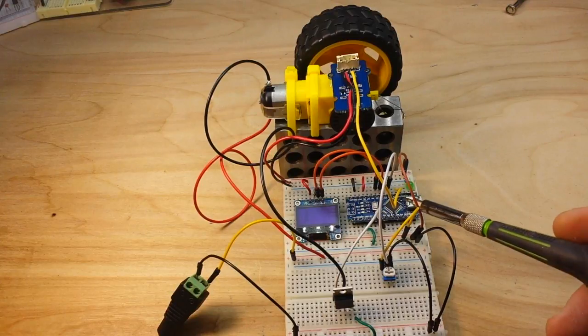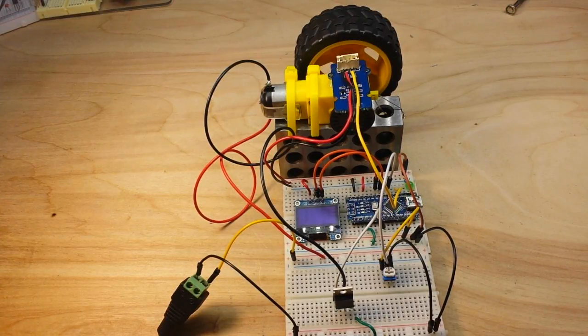In the second video we determined that this motor pulls far too many milliamps for our Arduino — in this case a Nano. According to the specs for the ATmega328P microcontroller, we don't want more than about 20 milliamps sourced per pin, but this motor was pulling upwards of 200 milliamps under any drag — about 10 times, an order of magnitude greater than the Arduino can output.